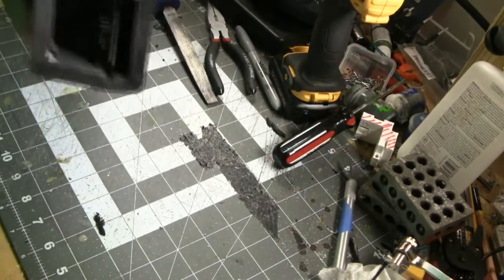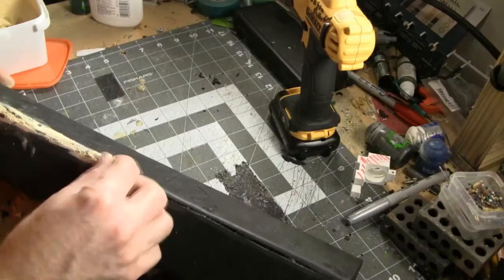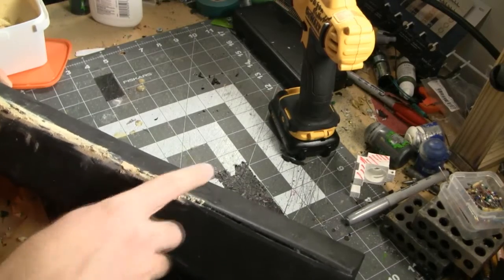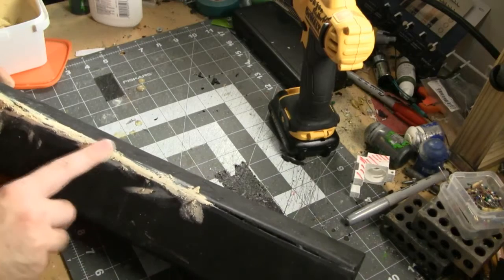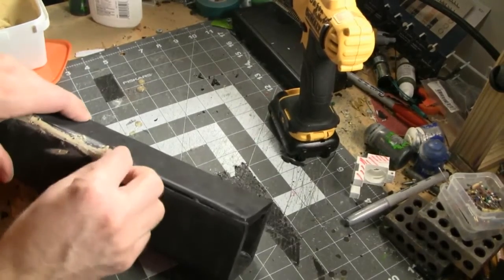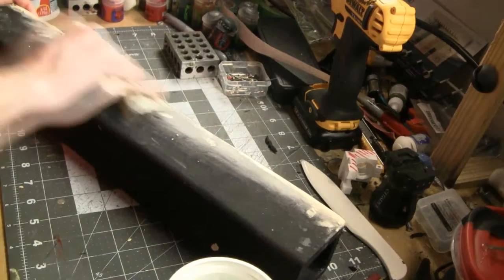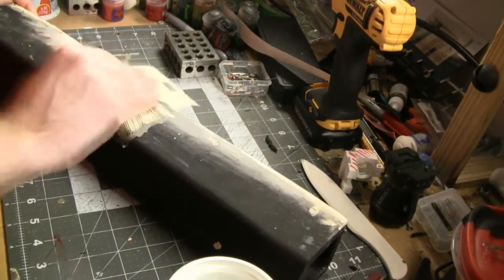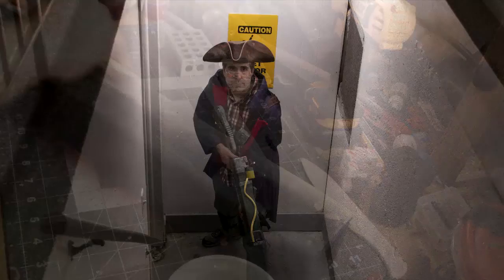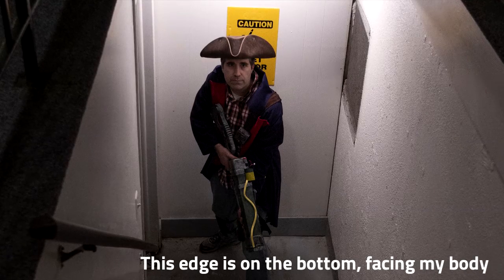Here's the downside of having the barrel join on one of the four edges: it doesn't automatically get a nice bevel like the other edges. I did a little pre-dremeling on this edge to give it a slight bevel, then I'm taking some wood filler to fill in the gap left when gluing the two sides together. After the wood filler dries, I sand it heavily to try to match the bevel of the other three edges. This edge doesn't work out great, so the strategy is to hide it — keep it as the hidden bevel when holding the rifle for pictures, so the good edges face the camera.